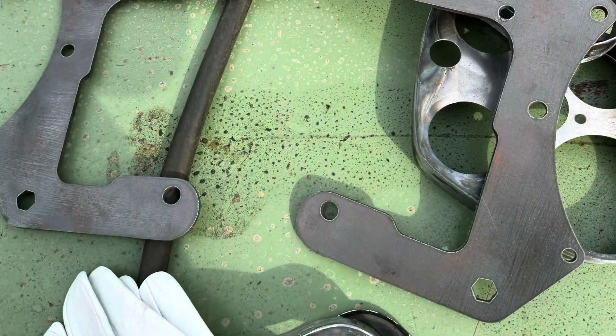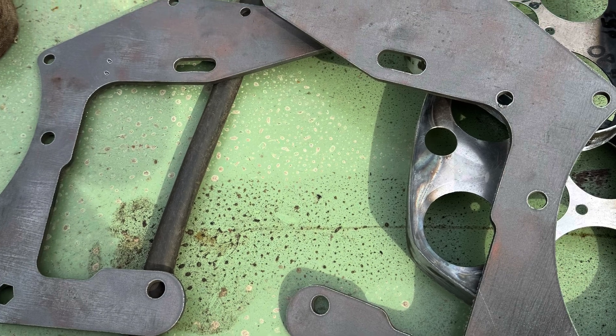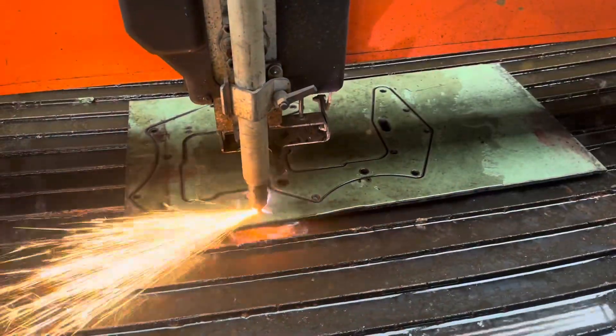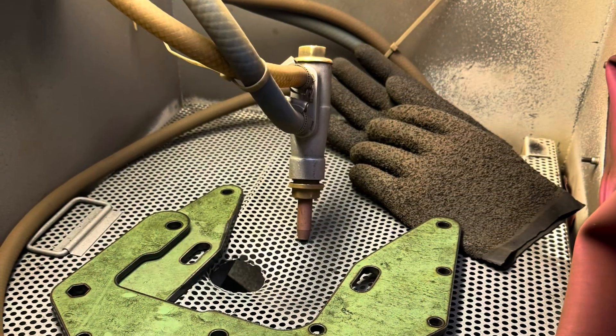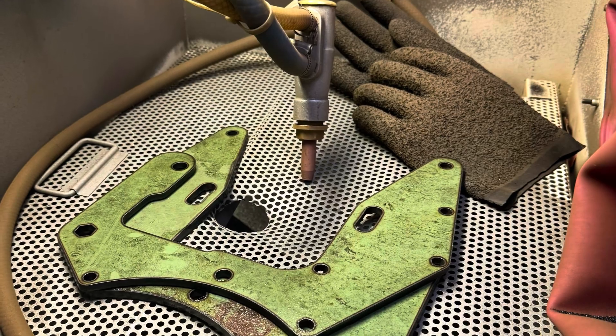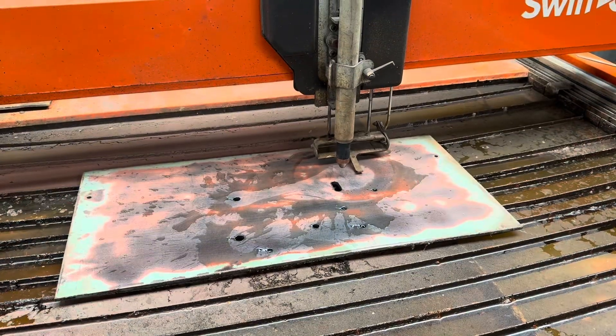Most of the forming was already done — Pat just had to form the ring around the edge and we just had to weld them together. While he was round, we also cut some engine mounting brackets for a Matchless motorcycle. We made these out of quarter-inch reclaimed steel plate so that they were era-appropriate, as all the bike's components are in imperial.